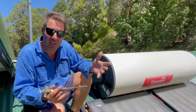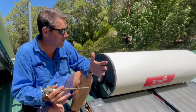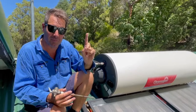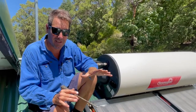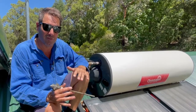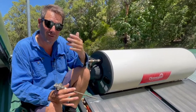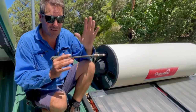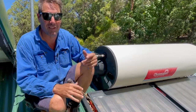So if you have it at 3 o'clock in the afternoon on a 40 degree day and your solar just suddenly starts dumping water from the hot valve, it's just reducing the temperature. As soon as that temperature drops with all the cold water getting introduced, it should turn off. If it doesn't, and it just flows all night as well, then there's a problem. But if it's just dumping for an hour or so, all it is is dropping the temperature so the thing doesn't explode.